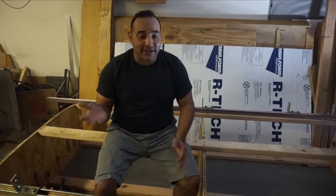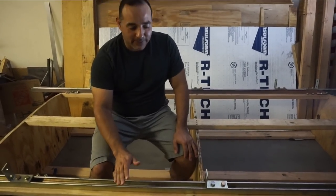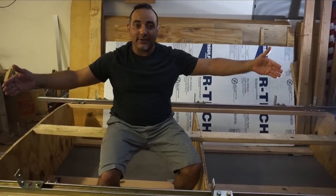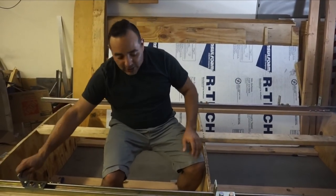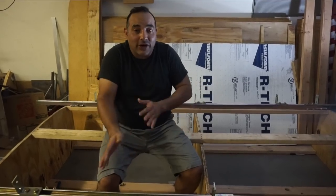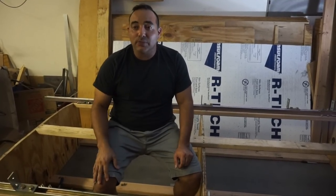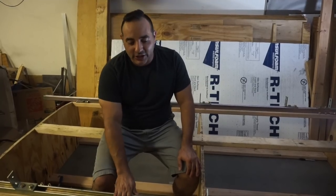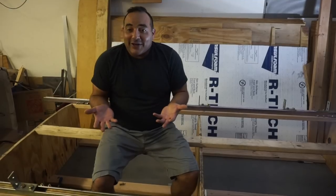We're not afraid to fail — we'll be the first to admit if it doesn't work and we'll try something else. That's one reason we went with the super strut system. The base will be a super strut across a 27 to 28-foot span where we can mount brackets wherever we need them. If this doesn't work, there's a good possibility we could sell these panels for what we paid, then get smaller panels and reconfigure them to work with the same super strut.